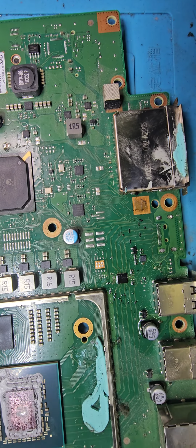Just see if this will power on since I've removed the display chip from it. Yeah, this one I'm still getting the same result. You probably won't be able to see it, but the LEDs do power on a little bit and then off. So yeah, still got the same situation here. So it might not be a case of a faulty HDMI chip. Let me just make sure that there's no bridges underneath the HDMI port itself. And we definitely don't have bridges down there.